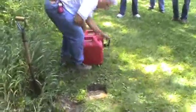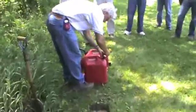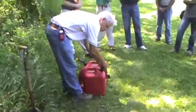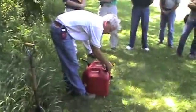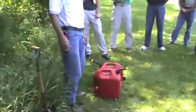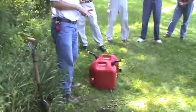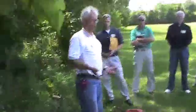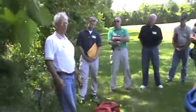Our marker indicates where the water level is when we started timing it. For most soils, you're going to want to fill it up and then come back four to six hours later and measure how much the water level has dropped. From there it's very simple — you use a yardstick, ruler, tape measure, whatever, and measure from the water level at that point up to my stick.